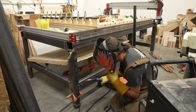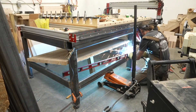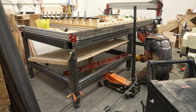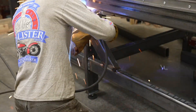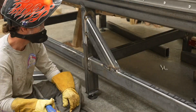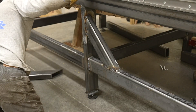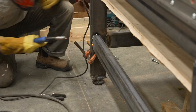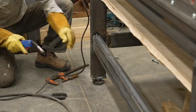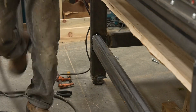I opted to use my MIG welder due to speed and ease of use. I roughly aligned the longitudinal pieces with my existing supports and tacked them into place. I wanted to minimize warping of the table by applying excessive heat, so I did a lot of short welds, waited for it to cool a bit, and then would add a little bit more after it was cool. These pieces aren't really structural — they're not supporting the table itself — so they don't really need to be deep, really good welds. In fact the short welds were pretty ugly, but I'm going for functionality over beauty.